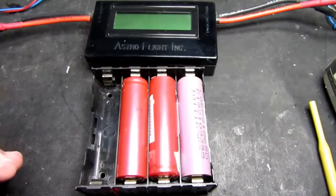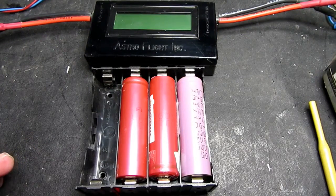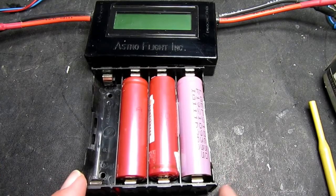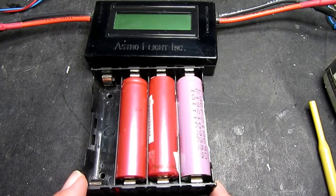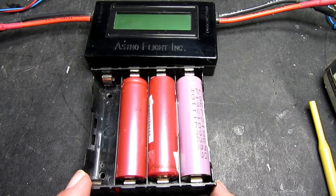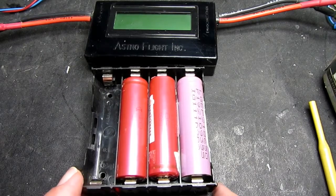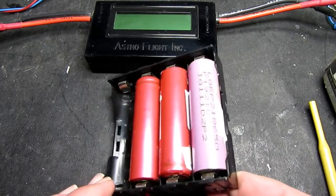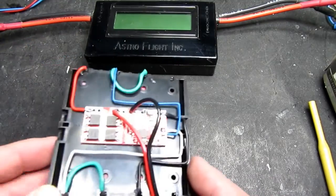But obviously I need some means of charging it. So these cells are, remember, unprotected. So if something goes amiss, they're overcharged or misused in some way, they could go bang or cause some other problem. So what we need is a way of protecting these cells.